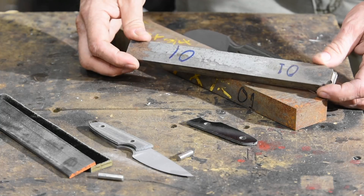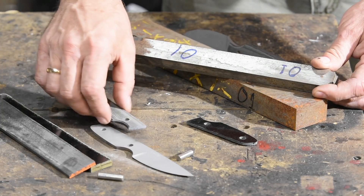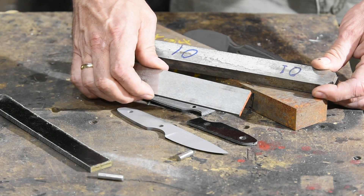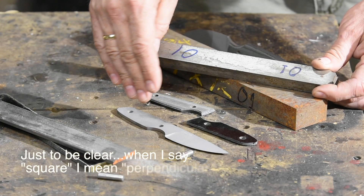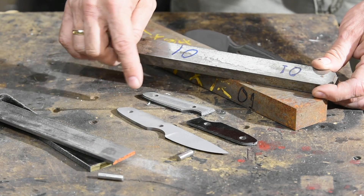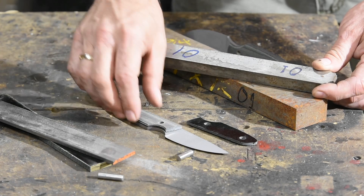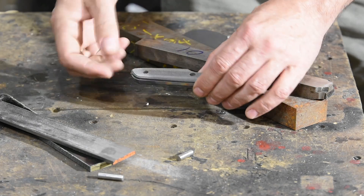What we're talking about is using a piece of material to make a jig so you can drill holes down through the jig, through the handle material, and through your blank piece of steel. You'll end up with holes that are nice and square, located in the correct places, and at the correct distance — because if you can do all of those, you don't have to stack all kinds of stuff up and manipulate it through the drill press.